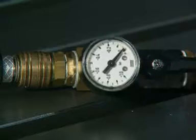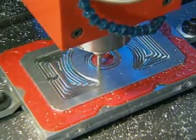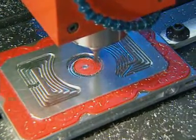To demonstrate the action of the lipped edge suckers, a plate of glass is placed over the vac mat. When the vacuum is applied, the lips deflect outwardly, pulling down the component — or in this case a plate of glass. When the vacuum supply is removed, the lips reform. The vac mat's unique design enables components to be machined through without losing vacuum hold down.